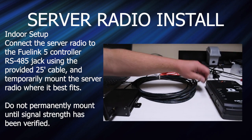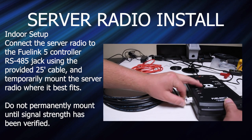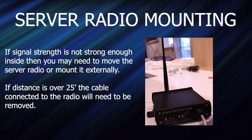Indoor setup should be attempted first by connecting the server radio to the FuelLink 5 controller using the RS-485 jack and the provided 25-foot cable. Temporarily mount the server radio where it best fits. Keep in mind, do not permanently mount until the signal strength has been verified. If it is determined that the signal is not strong enough from inside the building, you may need to move the server radio or mount it externally.